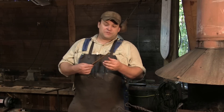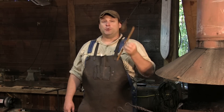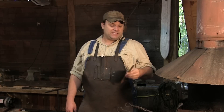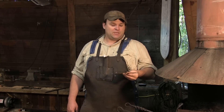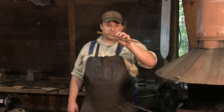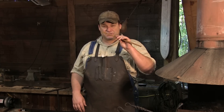The stock we're going to be using for this is our old half-inch by three-sixteenths. You can also use quarter-inch for this. Quarter-inch is a little bit beefier. I usually prefer it in something like this, but again, half-inch by three-sixteenths or quarter is the stock we're going with, and it is cut 13 inches long.